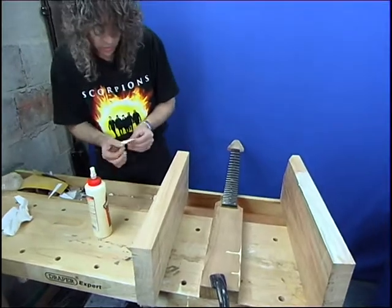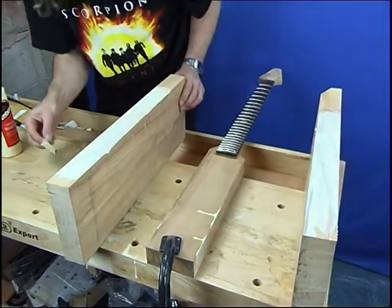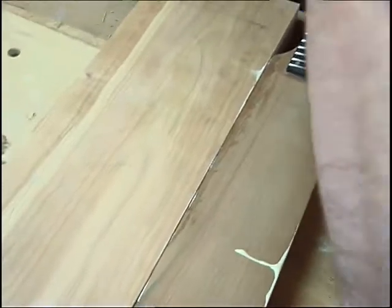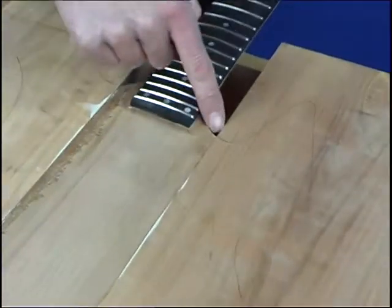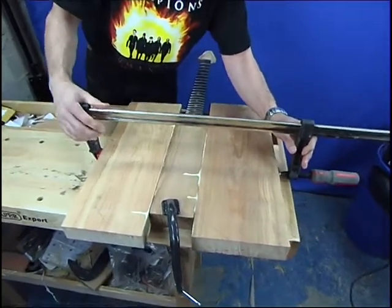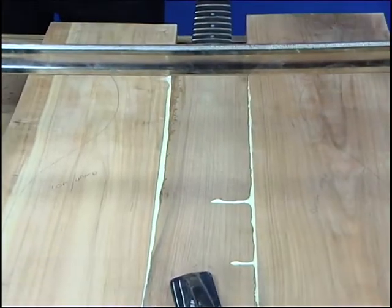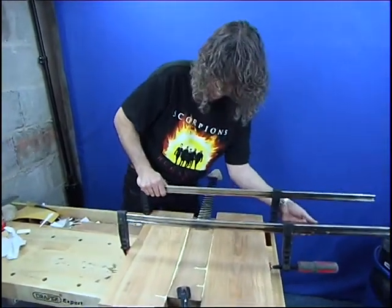Same again — we only need to put the glue from about there. I think we're ready to pop that into place. We're going to line that up with our previous marks. Line that up with our marks here — make sure that lines up. Close enough. I'm going to clamp the middle first, try and get that into the middle so it's not pulling on the wood at the bottom — that covers the whole area. Then we're going to clamp right away to the end here so that we get good leverage and really pull the wood into shape.